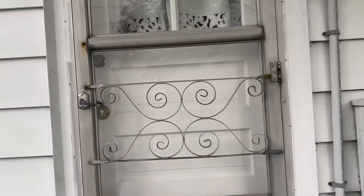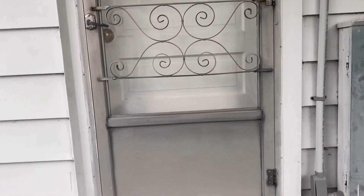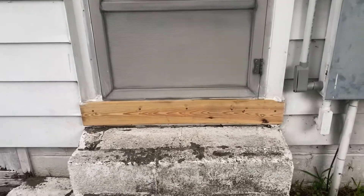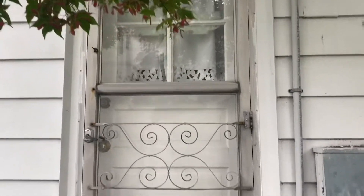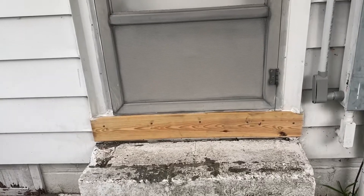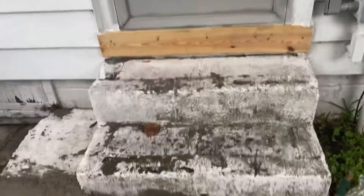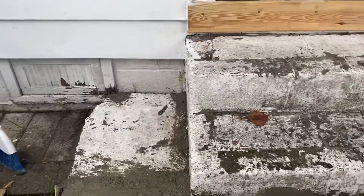Hello, welcome to 62 to Freedom. You know my side door over here by the kitchen — the steps were looking mighty pitiful. The water coming off this door had rotted the fascia board right there, so I dug that out, made it all smooth again, and put a fresh board there. Then the steps had big cracks, so I fixed those too.